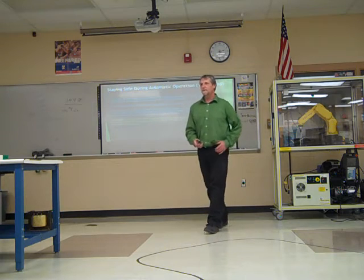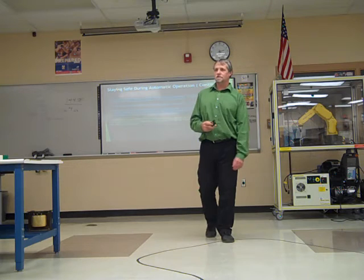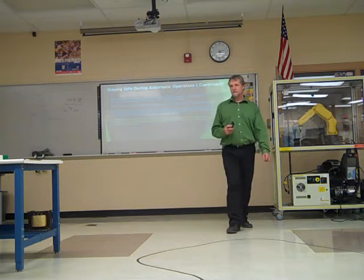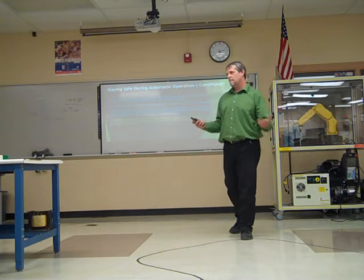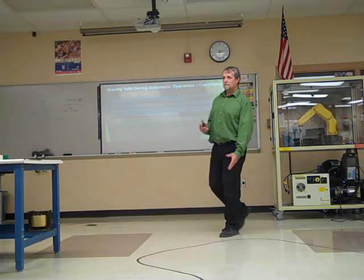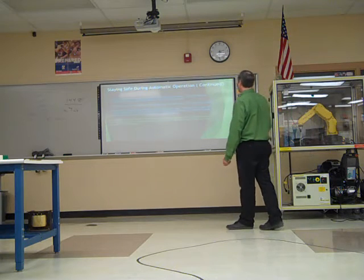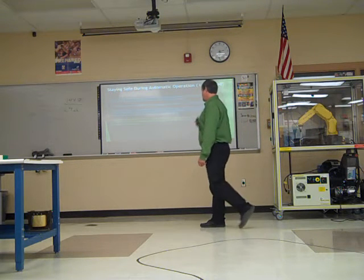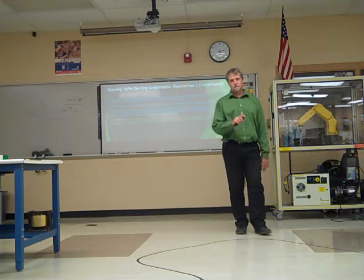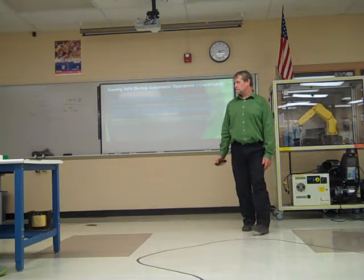If it's not an emergency, put it in step mode, let it finish its step so it'll end that step in a good way and not just hold it right away. Or you can put it in hold mode. Again, if it's an emergency, by all means hit the E-stop. If it's not an emergency, there are better ways to stop it at the end of the step. It should be noted that the E-stop should only be used, again, in an emergency. In the case of this, we've already run it through step mode enough that you know you can step it through without having to hit the E-stop to stop it if it's not an emergency.